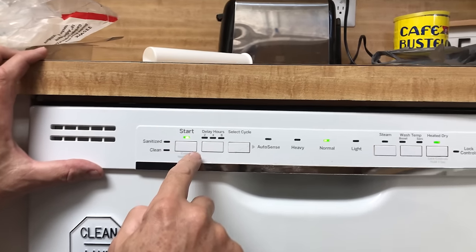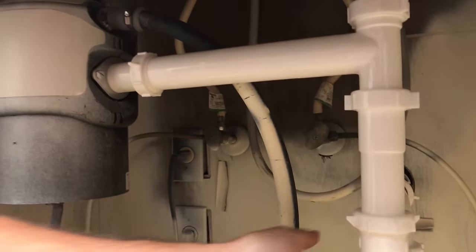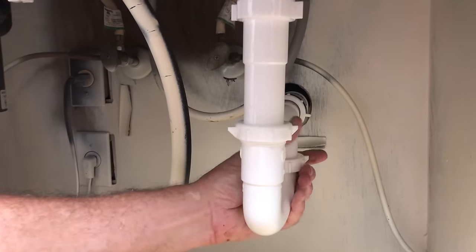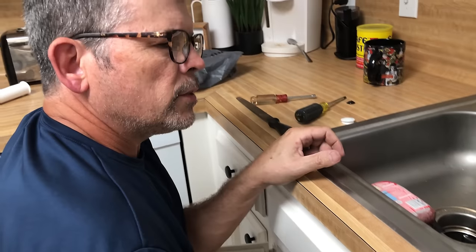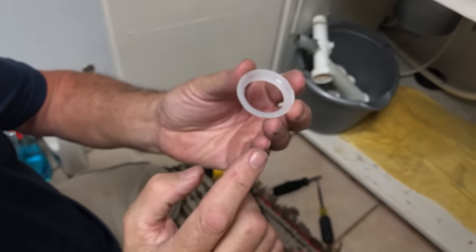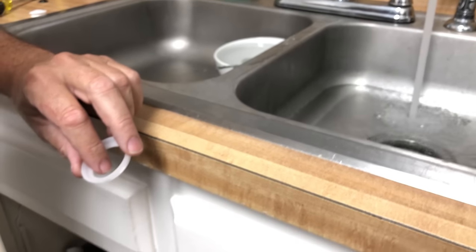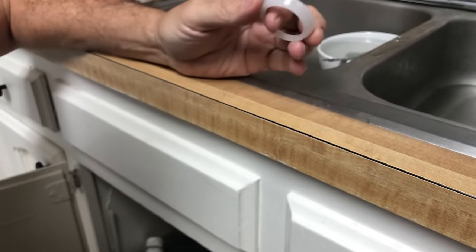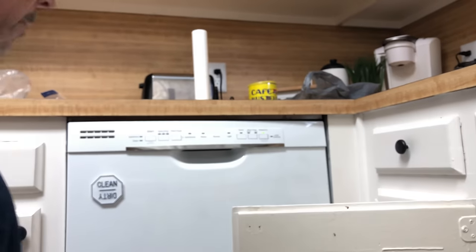While that's running I'm going to start the dishwasher — we'll be able to test the dishwasher drain in a second. All dry. I always like to use a stopper and give it a real good flow test. I think we're good. We have this washer left over — that's for if you're hooking up a bathroom sink with an inch-and-a-quarter tailpiece. Kitchen sink tailpieces are inch-and-a-half; bathroom sink is inch-and-a-quarter. We chose the short connector so that longer piece is extra.